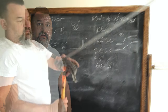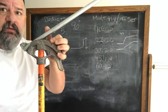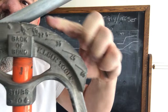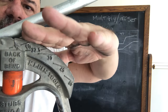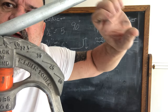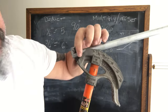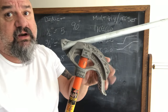Let's start with the pipe bender itself. Those degree markings I mentioned are right here on the bender — those are your radius indicators. They need to be parallel with your pipe. When the pipe bends down, you know where to stop: want a 30, stop there; want a 45 or 60, bend it down until the bottom is parallel with that mark. At the back of the bend there's a little arrow — that's going to be your first mark for offsets.